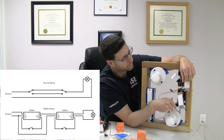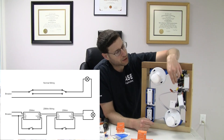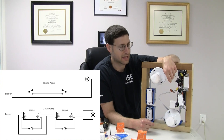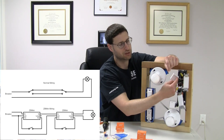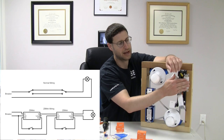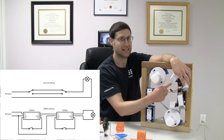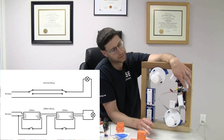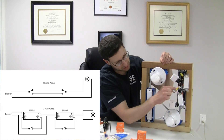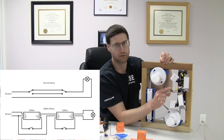All right, the power's killed. Now, what we have here is main power coming into this box here. And then it goes into this to power this. But the actual load portion is not hooked up. So it goes into this, and then the two switch terminals go into this switch. So now you have this switch that controls the actual relay in here. But the relay is not actually doing anything — it's not hooked up to a load. The actual neutral and the hot are bridged directly to the neutral and hot on this existing three-way. You can see that I capped the red wire in that three-way because you don't need it anymore.